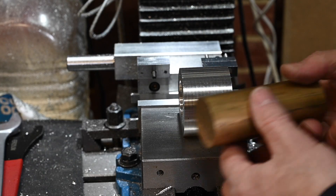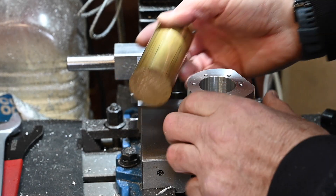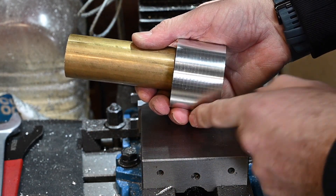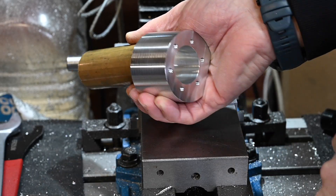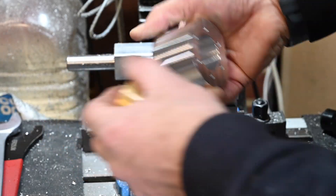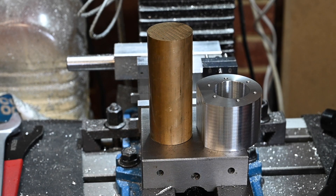What I need to do is get a mandrel. I've got this piece of brass which I'm going to make the cylinder liner out of. So what I'm going to do is turn the OD of the brass down, press fit it into there, and use the brass as a mandrel so I can do the outside features. Then I'll drill and mill the centre out to form the bore — the brass will be in there and I just have to form the bore inside the brass. That'll be the cylinder liner, all done in one procedure.